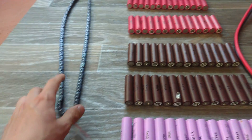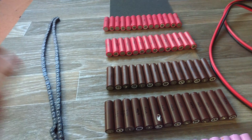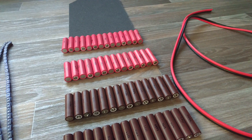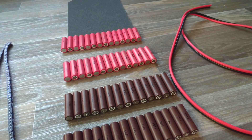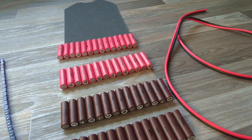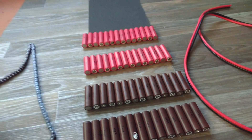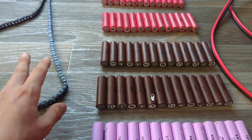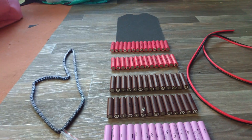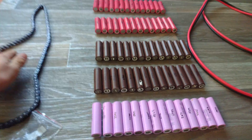I've got my T8F chain as well, which is a lot thicker than I expected. I've got chain links for that, and I'm also thinking about getting a 54-tooth sprocket to make my gear ratio a little less demanding on the motor — it would be a 6:1 ratio rather than a 4.8:1. I'll probably lose a little bit of top speed, maybe 15–20 km/h, but I don't really care — it's mainly the acceleration I'm after, which is the most thrilling part of having an electric bike. I'll have both sprockets so I can change it if I want to.